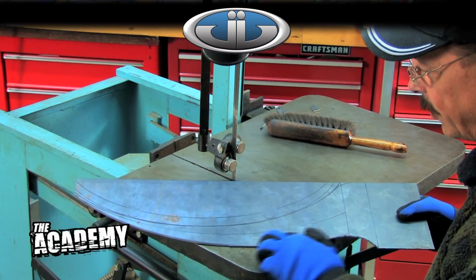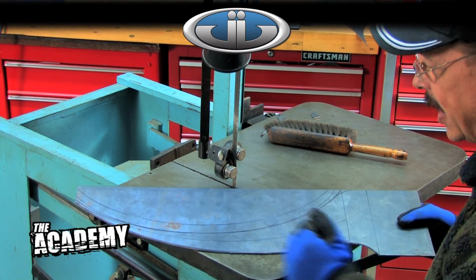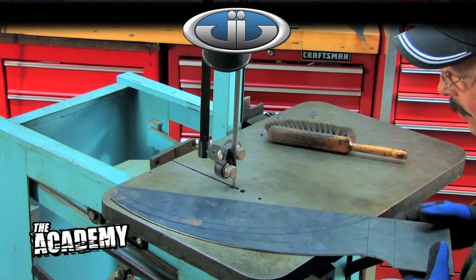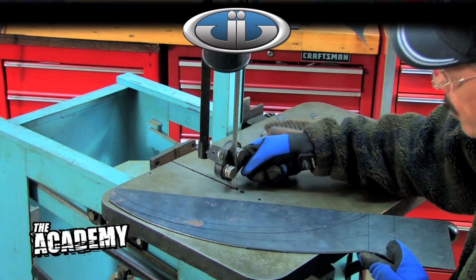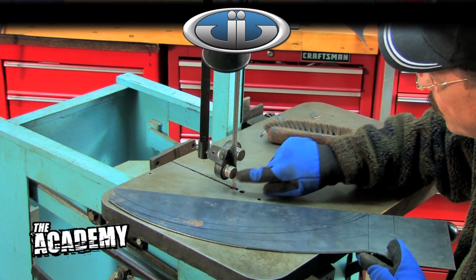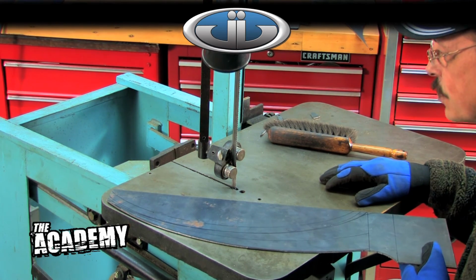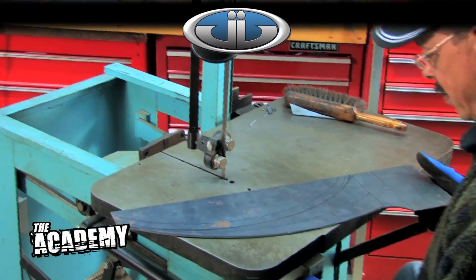That's a little bit more difficult because on the outside, if you fudge a little bit, it's usually to the outside of the line and it doesn't hurt you. But when you're cutting the inside, if you get your radius a little too tight and you don't watch it real careful, then you can cut into or past the line of where you really want it to be. So this being thinner material, you can fudge a little bit more and twist it. You just got to be careful you don't twist too much, because as you twist your part, you're twisting the blade. It doesn't twist this easy down here. That's what this support is for. This is fairly rigid. But as you start putting too much pressure on it, you twist the blade, you twist it too much, the blade will pop. And aside from being dangerous, that's about 30 bucks every time you pop one. So we'll go ahead and start cutting the inside radius.